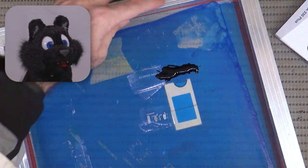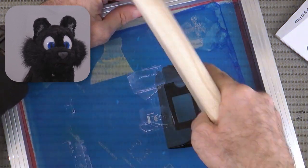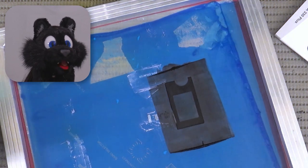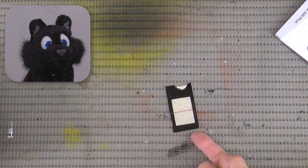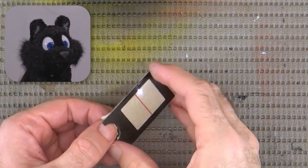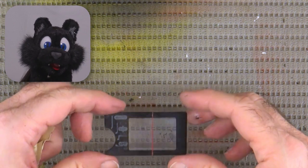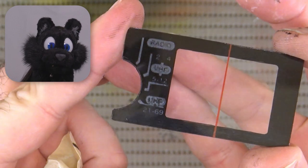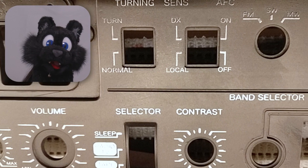Which went okay-ish. Well, there are two problem areas. The tape counter label was a total mess and I didn't clean the screen in time, so that part is now clogged up. And the main panel has some slight blurriness on one side because the mesh shifted slightly. Oh well. Sanding all off again and repeating the process would have taken way longer than I'm willing to invest in this project. So, way nicer than before, shall be good enough here.